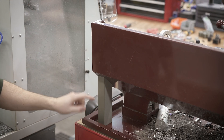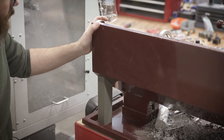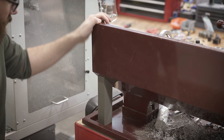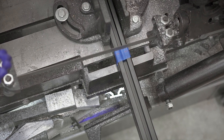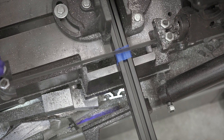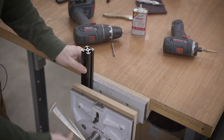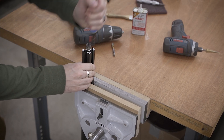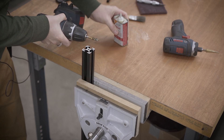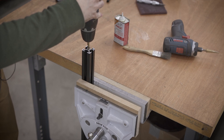And there it is. I used some carpet tape and when I actually lift this up it's pulling up the chip tray with it - so you could break this free if you really wanted to, but yeah that's holding. Now that the foot is in place it's time to cut the extrusion. I ended up with about 28 inches and this stuff cuts beautifully on the bandsaw, though you can use a hacksaw if you wanted to. The last thing before assembly is to tap the ends - it's set up for an M8 tap, so I'm using a spiral flute M8 with some tap magic.